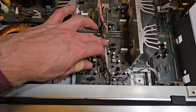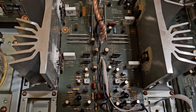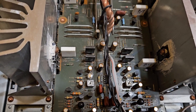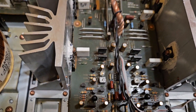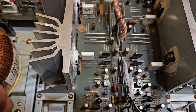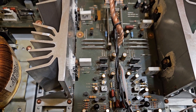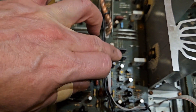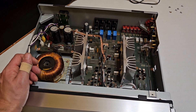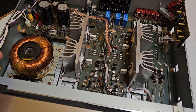I suspected dry joints, and indeed I was able to reflow the solder on those on the underside. To be honest, they looked pretty good — it was barely visible. Sometimes you can see a big crack or the lead wobbling, but these you couldn't really see anything, maybe just a slight crack around the wire. But it definitely firmed up those transistors, and after a few days, no ticking noise. So experimentally, that seems to have fixed the problem.